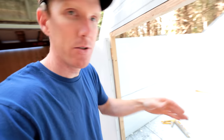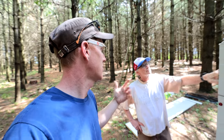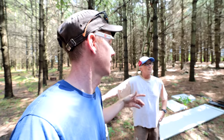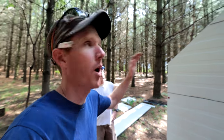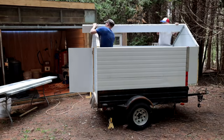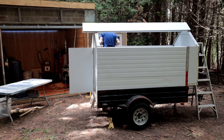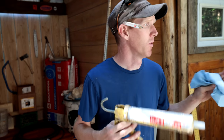The debate was whether to overhang the roof at the front and back. But this thing is going to travel at around 100 kilometers an hour — about 62 miles an hour — and we probably don't want a lip at the front because the wind will come over and go underneath and try to rip our roof off, which would not be ideal. So I'm thinking of doing a flush roof at the front and then overhang at the back, because if it overhangs the back it gives you a drip edge so it's not dripping inside when the door's open. Here's the greatest opportunity to use every spare tube of caulking you have laying around. I'm going around sealing up all the joints, cracks, and crevices to make this thing watertight, and then I'll use some sheeting tape or blue skin at any major cracks for further waterproofing.